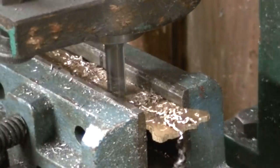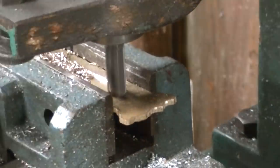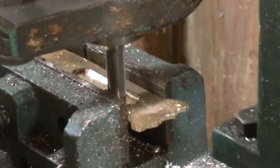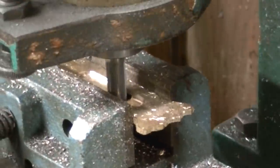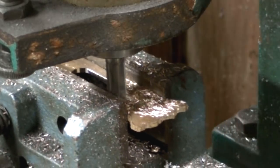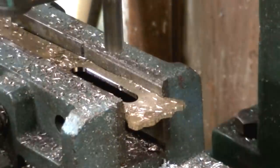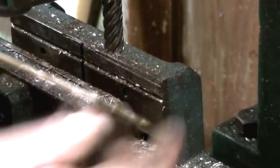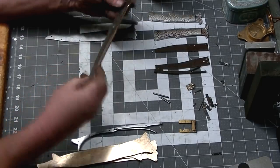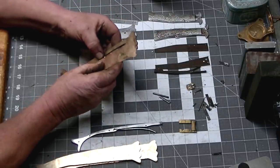Anyway, the scale on the lever side has to have room for the lever spring in it that we riveted to the inner liner. So we're going to mill all the way through this guy. And when we double these plates up, it'll leave this cavity for that particular spring and pin as a release pin. There you go. All right, so that's where that is going to fit. And this will layer the top of it.